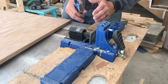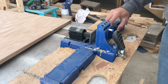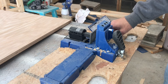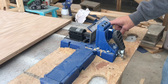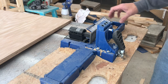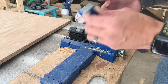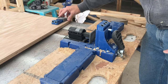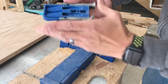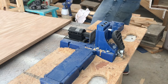This is the bottom piece. I've got it set to three quarters of an inch, which is the material size I'm using on this Kreg K5 jig. It says three quarters of an inch — use inch and a quarter screws. Material thickness and screw length is what you're looking for. My material thickness is about three quarters of an inch. If you don't have one of these, you can get a simpler version that just clamps to the edge — you drill your holes and set the depth. This one is about $25 on Amazon; I think this one is about a hundred. This is much more convenient — I've got it screwed to a piece of OSB.